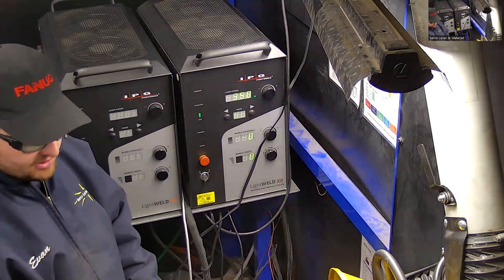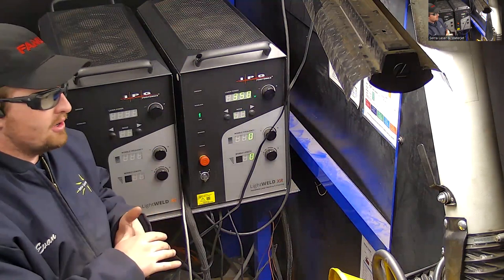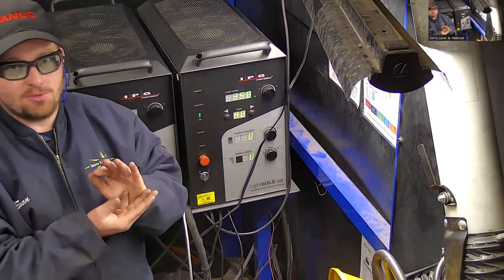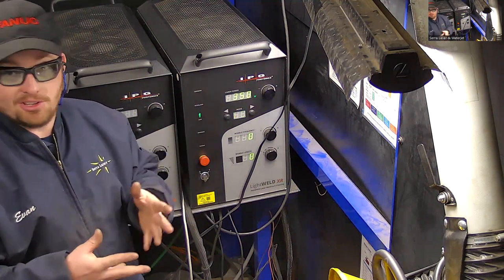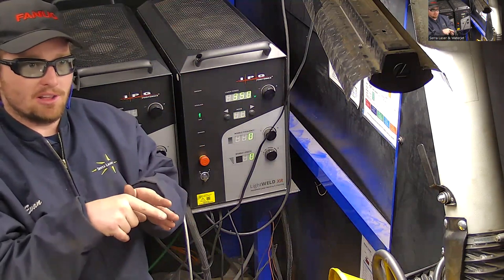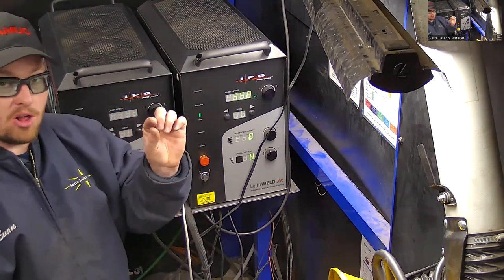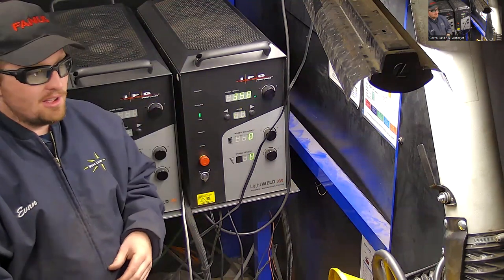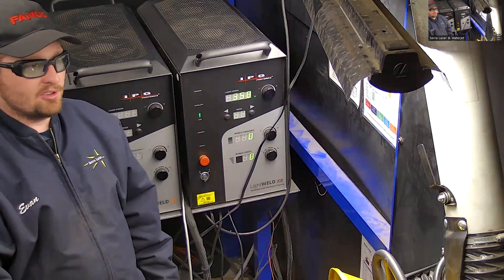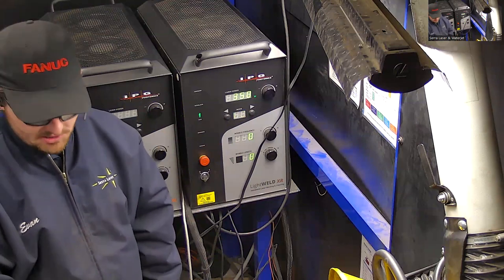What I use fuse welding for a lot is a T-joint or any joint where the pieces are touching really nicely, and I can use the fuse weld. If I want to add a little bit more structure to that joint, I'll use the wire. It gives it a bigger fillet. Still a very small appearing weld on the surface, but the laser penetrates really deep into the metal, so it creates a strong joint, even though the weld appears smaller than what you'd be used to with a TIG